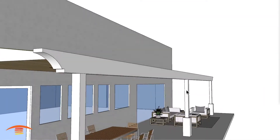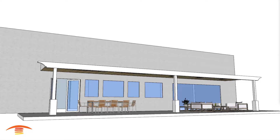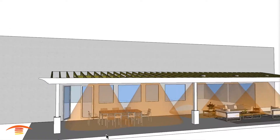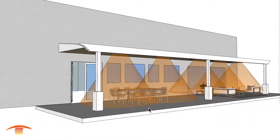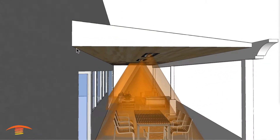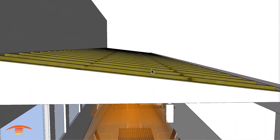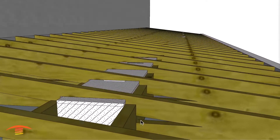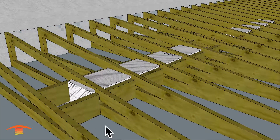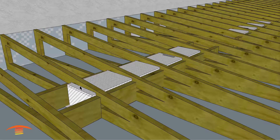Just to give you an idea of the footprint of heat — here we go with the footprint of heat with the two 6,000-watt units, you're getting good coverage through the span over here and a fairly decent coverage here as well. From here to here is the center point of the heater. Also, whatever this construction is, you need 8 inches of height for the inside of the finished ceiling — it needs to be 8 inches tall so that you can fit the frame and the one-hour fire-rated drywall space.